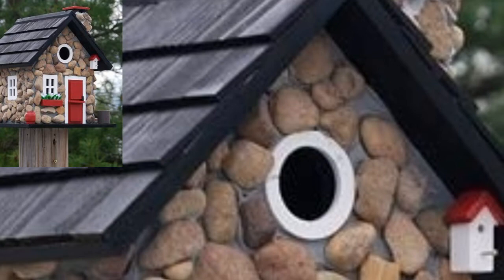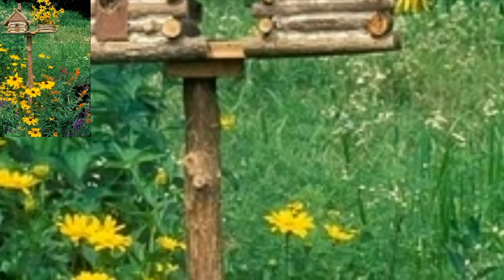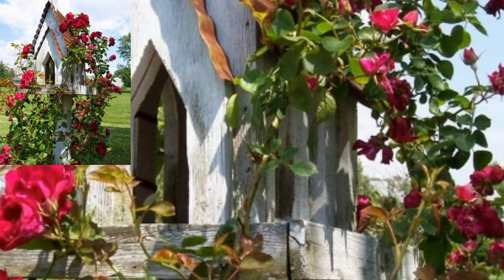I've made a lot of hanging garden bird houses and typically the box hangs from eye bolts secured into the roof. This creates a point of failure — after hanging outdoors in the elements and swinging in the breeze, the roof tends to pull away from the body of the box. A simple modification solves this problem: drill small holes in the front and back panel just under the peak of the roof and thread a cable of wire through the holes. This creates a much stronger point of attachment.